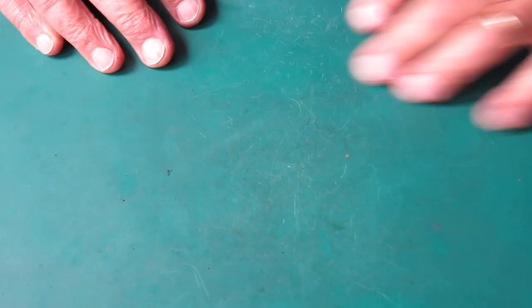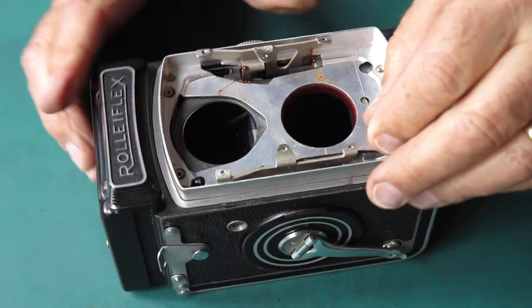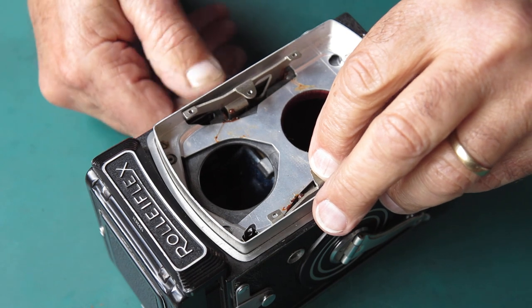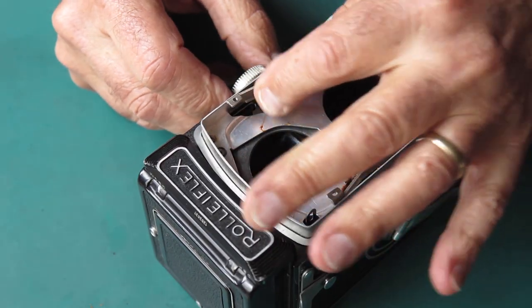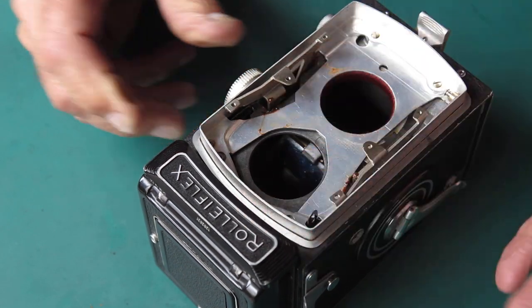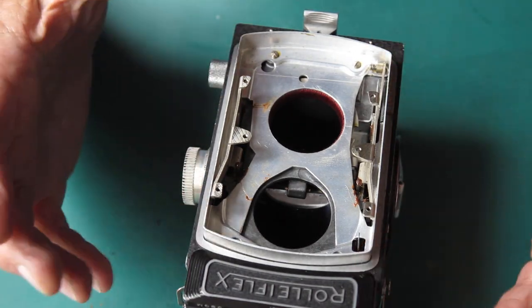The front panel would be ready to go back onto the camera once the shutter and so forth has been fitted back. But there's no danger I'll be fitting the shutter back anytime soon, because first I need to deal with the camera body. My most pressing concern is the state of the focus mechanism. On one side the support is quite firm — no side to side play, moves smoothly with the focus knob, not a problem. This side, however, has a rattle. Something here is not right, and whatever is causing that rattle is probably also causing this business where things stop and don't move at the same speed. I'm going to have to investigate that by getting into the focus adjustment side and taking this front piece off.